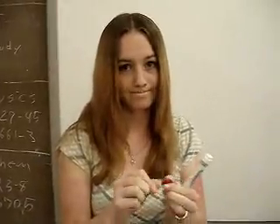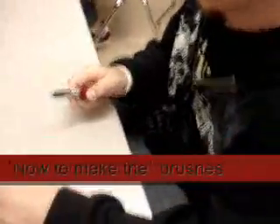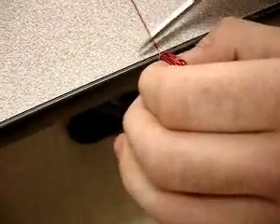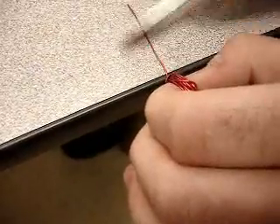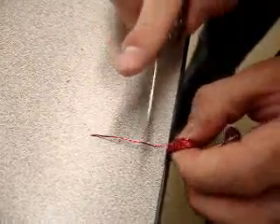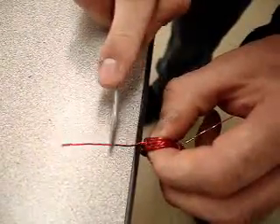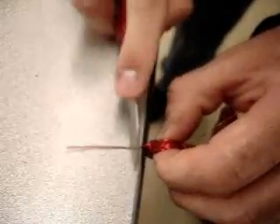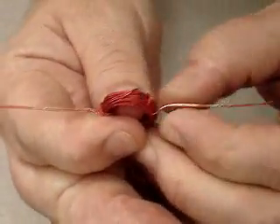And time for the wire stripper. Here's a close-up of that armature. Go ahead and take that coil, hold it out to the side, and then scrape the wire. You need to scrape it away to nice shiny copper wire. You'll notice that he's holding the armature straight up and down while he scrapes. And then let's do the other side, holding the armature the same direction so the shiny wire is up on the other side.